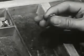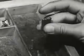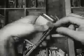From the right end of the line, take a few pieces between the thumb and first finger. Then change to the thumb and middle finger, sliding the thumb down. Roll the thumb to separate the letters. Watch how the first finger moves back to release one letter at a time. Tip your wrist to let the type trip gently over the middle finger. In slow motion, you can see how the type lands on the body, not the face.